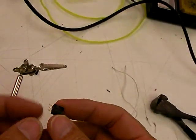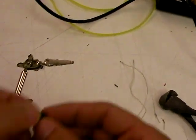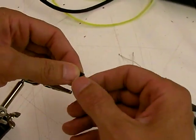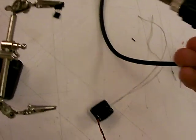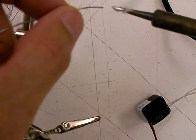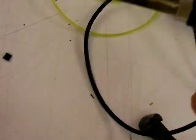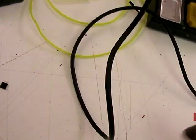The connection to the receiver is going to use 0.10 inch headers. I've got these nice little prefabricated ones that fit receivers pretty well. You can get these at places like Digi-Key. The important bit here is I'm going to be running with a little heat shrink, so we want to heat shrink things up. We'll slide these over before I make up this joint.